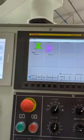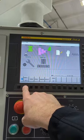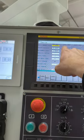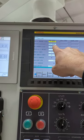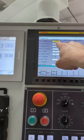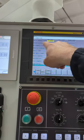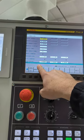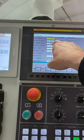We're going to go through a wheel setup actually. And we go to wheel data. And then we're in dress condition. Right now, this is what I have it set at. I have per pass dress off 8/10 at 10 inches a minute. Dress one time. And allowance, let's talk about that.